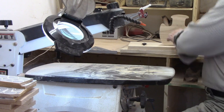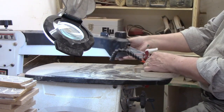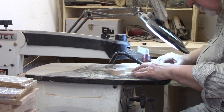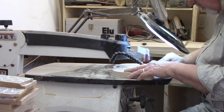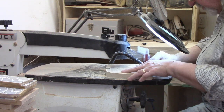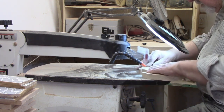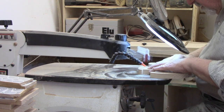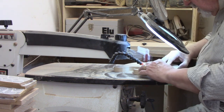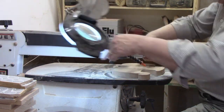The inside cuts for the door and window are rectangles with rounded corners, so a newbie on the scroll saw should be able to make them easily. Rounded corners are much easier to cut than 90-degree angles with sharp points. I drilled a pilot hole for each of the inside cuts, threaded the blade through the hole, made the cut, then loosened the blade and tossed the waste piece. I noted it only took about 10 minutes to cut the ark.